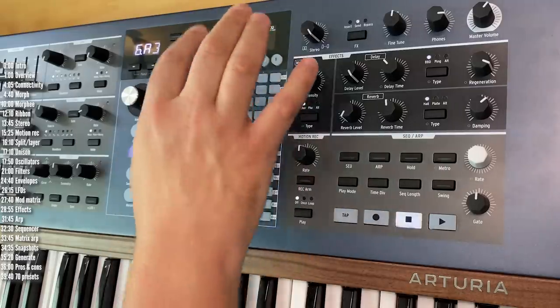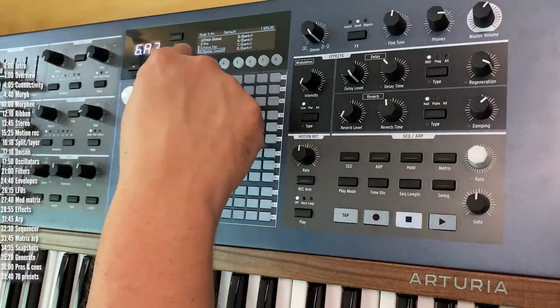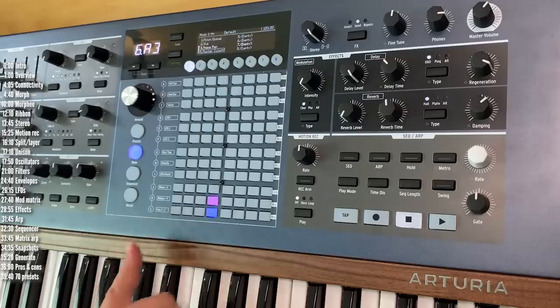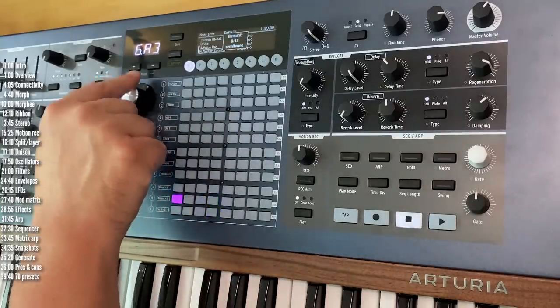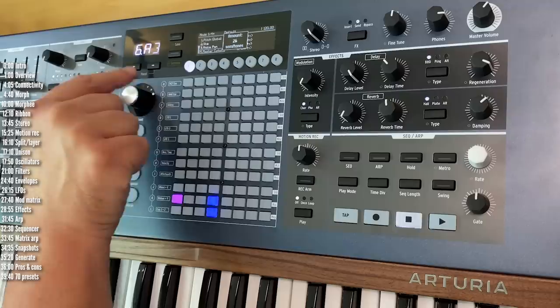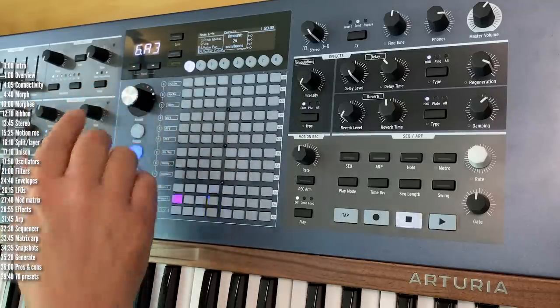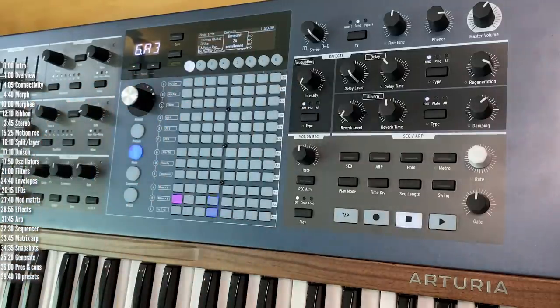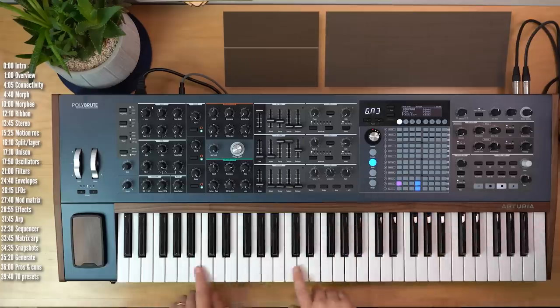But I think one of the coolest uses for this is to point the ribbon to the pitch of one or all of the oscillators. That's pitch global here in this case. So I'll go from ribbon to pitch global and set a mod depth. Mod depth isn't semitones. I found that for this to track according to the keyboard, 26 is the mod amount that works. Anyway, when I do that, I can use the keyboard as a guide to bend pitch here.